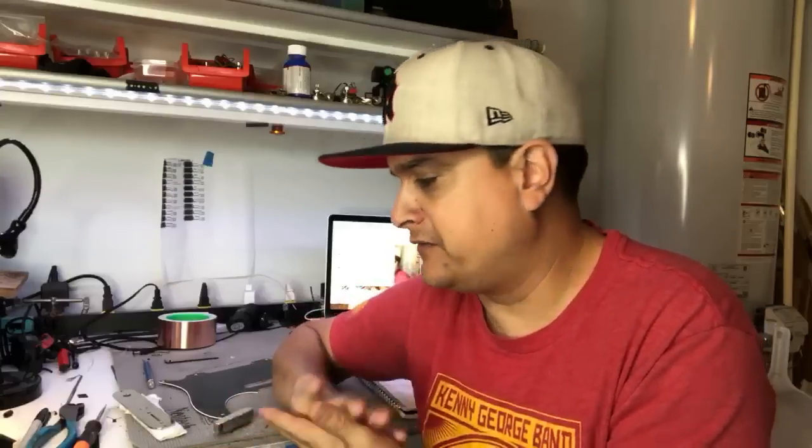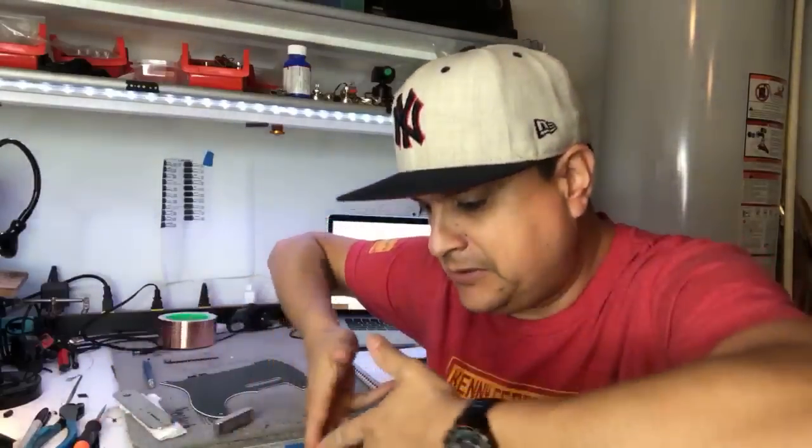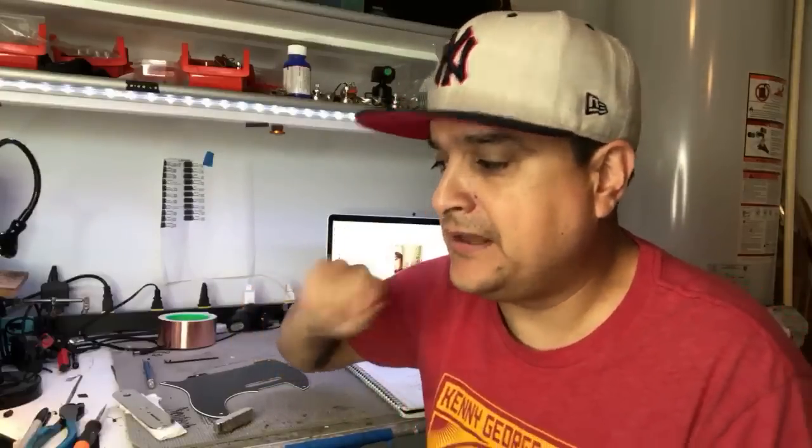So like on a Les Paul, let's say you have a guitar with two P90s in it, shield the pickup cavities. And if you wanted to shield the cover that goes over it and ground that just to get some square inches on there, that's cool, because you're just trying to get some square inches on there. But it is not necessary to take all that time and do all that really pretty copper stuff inside there and make a Faraday cage, because it's not doing a damn thing. In fact, it is not a Faraday cage at all.